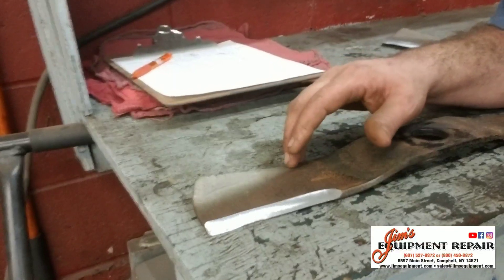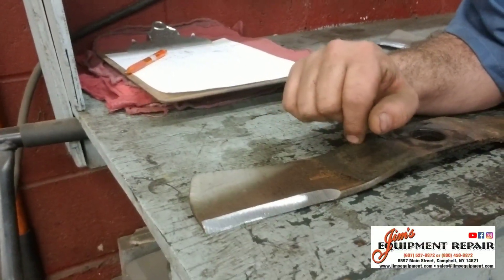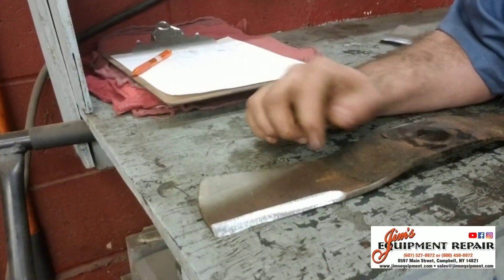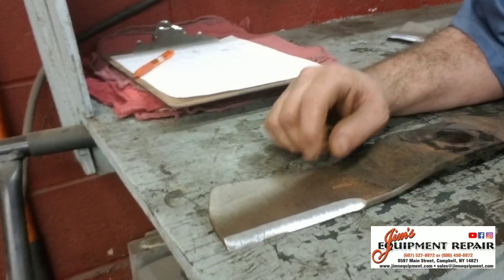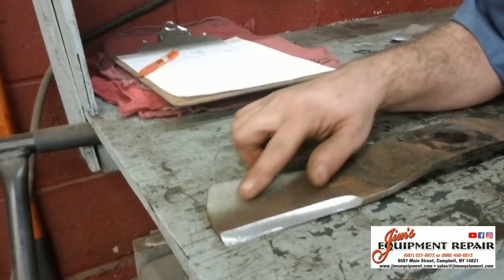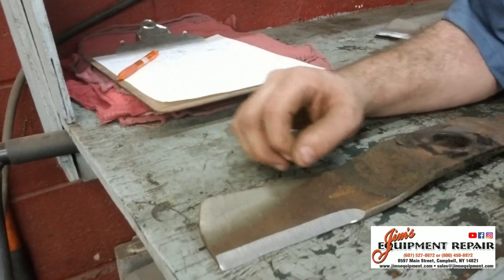As I mentioned, we already removed the blades on this and I've already sharpened them. We have a pretty slick grinder tool to match the right angle that was already pre-existing on the blade — this one I've already got nice and sharp. The other feature I check on blades is the wing tip — make sure that's in good shape.